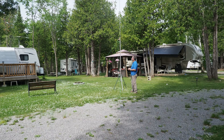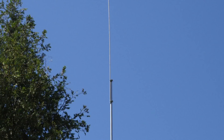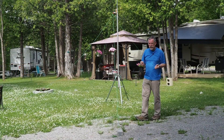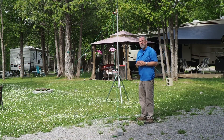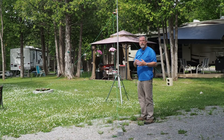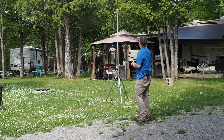The next piece is a piece of galvanized conduit, the half inch, and it's not worth a whole lot — I think I paid five bucks. That was the only piece I had to buy. At the top, I've got an old Citizen's Band 11 meter whip where the base was broken off, and that made for a great piece. So from the bracket to the top, I'm roughly 16 and a half feet. You're going to have to play with that measurement a little bit. You can take a look at a quarter wave calculator — we'll pop a link there for you. Anywhere between 16 to 17 feet is what's going to work.